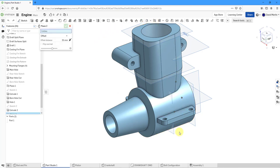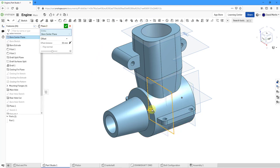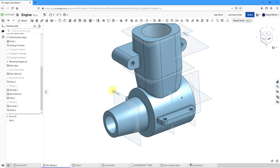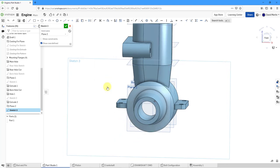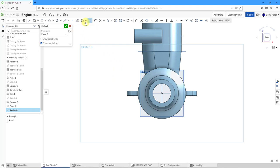Let's create a plane offset from the center plane — dragging it out to a distance of 140. Now I can hit the check mark, select the new plane, right-click and create a new sketch. Let's view normal to the sketch plane and create a construction line, make it horizontal, and put in a dimension. I want this located from that plane at a height of 65. That's all that's in this sketch — just reference geometry to facilitate constructing a plane at an angle.